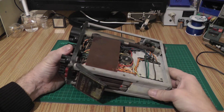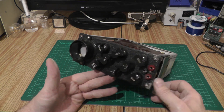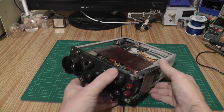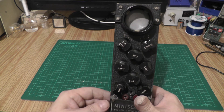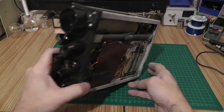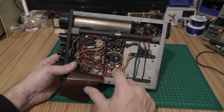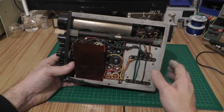The CRT has a metal shield around it — likely a mu-metal shield which helps exclude magnetic fields from the electrostatic CRT. It could do with one hell of a cleanup. The construction is very very compact and it must have been a lot of work for engineers back in 1947 to design this. There are a couple of places with chipped paint on the front, but the Bakelite knobs are looking fairly reasonable. Even the gold paint has survived between the knobs. With a little care and a paintbrush we can clean that right up.